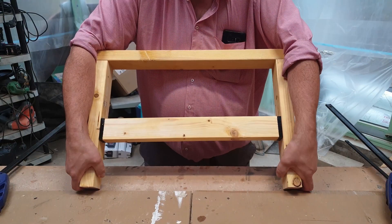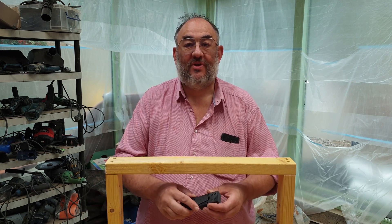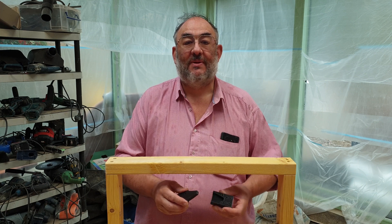You can see it's quite a robust construction and I would wager stronger than toe-nailed screws or pocket screws. We were so pleased with the ease, strength and neatness of the system, we've used them in other places in the patio unit as you will see when we get the video finished. We've even expanded the idea to a heavy duty version to be fitted to the patio enclosure for a lifting section. It's not fine joinery, but a simple device that, assuming you have access to 3D printing, makes a quick, flexible and easy way of joining or adding in a timber.